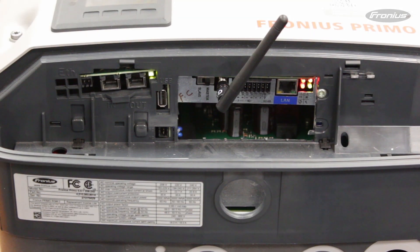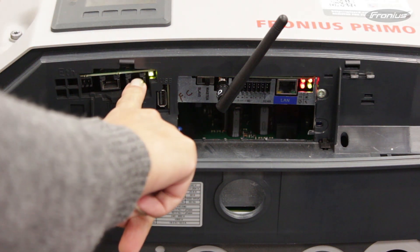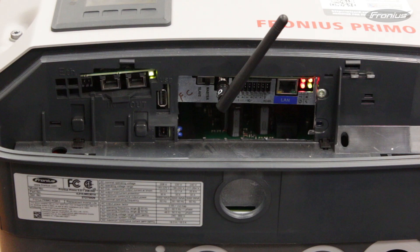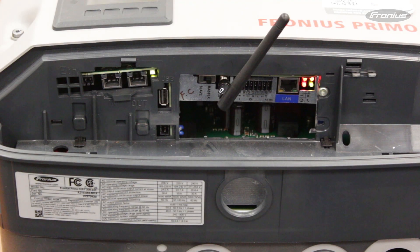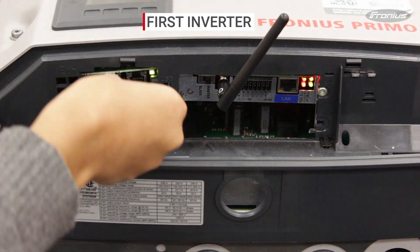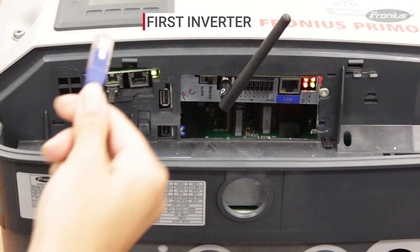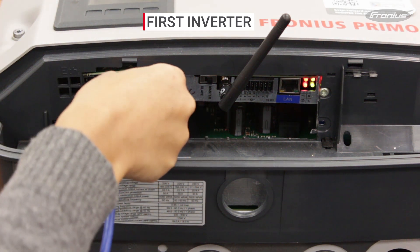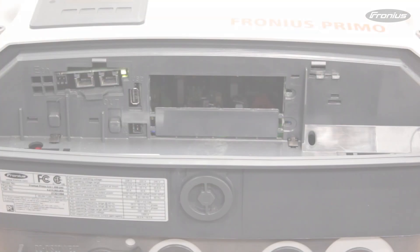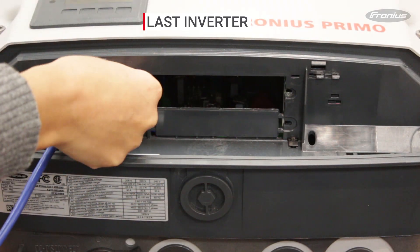Please look at the DATCOM area of the SNAP inverter. On the left hand side, there is the IN and the OUT solar net connection socket. When linking several inverters in the DAISY Chain Loop, please connect to the Fronius solar net IN connection socket of the first inverter with a termination plug. The OUT input of the same inverter should be connected to the IN of the next inverter. If this is the last inverter in the DAISY Chain Loop, the OUT should have a termination plug.